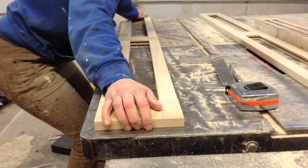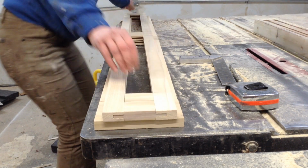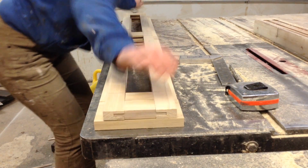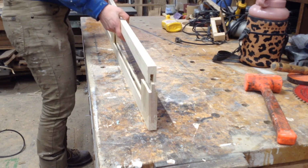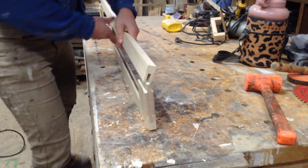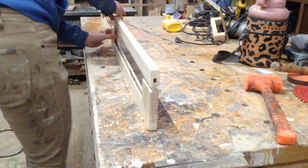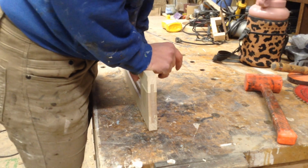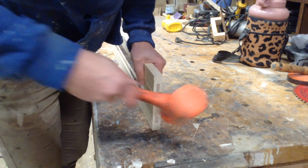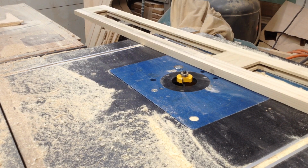So something that is going to be centered over a heating unit is going to be subjected to those changes at an extreme level, because being right by the heater means you're going to be pretty much zapped of humidity right by the heating unit in the winter time. So this thing's really going to shrink, and then in the summertime it'll have kind of the opposite effect. And since it's centered by that heating unit, when people are talking about all this movement, that's where it's going to be the most extreme.